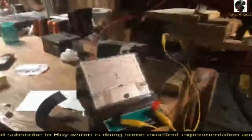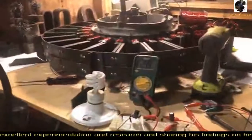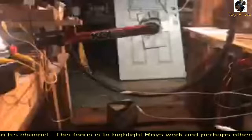You can see this side staying pretty steady with its voltage. So that's pretty much my tickler or my trigger voltage at a steady 1 volt, which is great. And then over here, I can multiply the voltage by a lot. So I can knock down that voltage with a resistor or a voltage regulator. So I can just control the voltage that goes into the transistor, fires the transistor, put a potentiometer on it, and I can control the speed here.